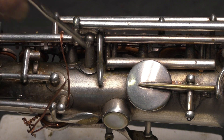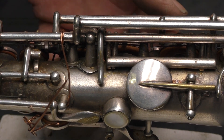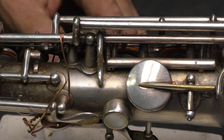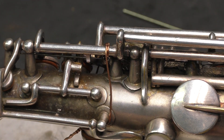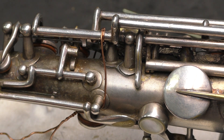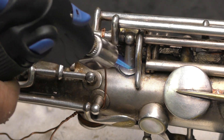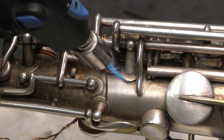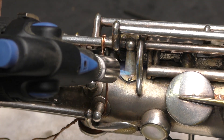One thing I've got going on here: I want to put heat here, but right behind this there are two keys that are pretty vulnerable to getting heat. So I need to put some kind of a little piece of sheet metal behind here if I can — even if it's a wet rag, maybe. Really all I'm after at this point is to just get this thing playable and have some fun with it for a while, and then get into a full restoration, which will be quite a journey. I'm going to try to be gentle. I just want to put the heat on that post, not the one next to it if I can help it. Never done this before — not on a sax. I've done lots of gas welding and soldering, and this is basically like plumbing — this is sweat soldering.